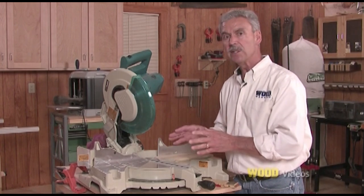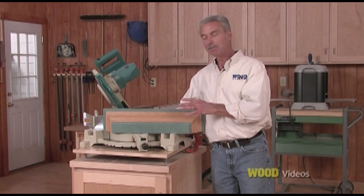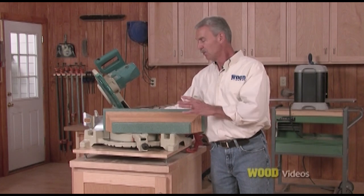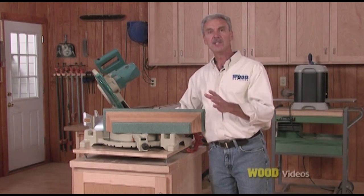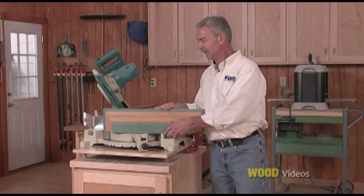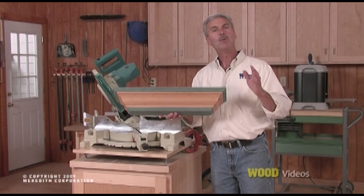It's just that easy. Well, now you've learned all the techniques it takes to install crown molding. And you've seen how templates will let you place that crown molding on your miter saw with no problem at all. And you've seen how cutting crown molding flat will make stabilizing long pieces, cutting real wide pieces or real short pieces really easy. Now, you're not going to generate much scrap, but you are going to generate some. Here's a project I made out of scrap material. Let your mind wander with the number of things that you can make. Now go out and crown something.